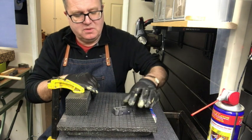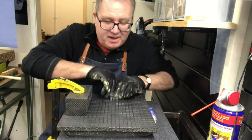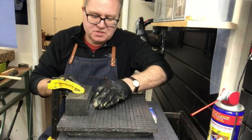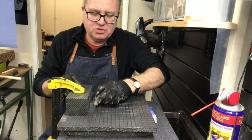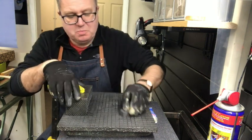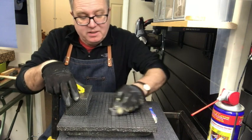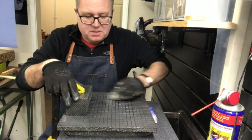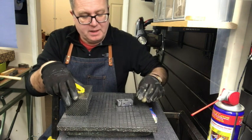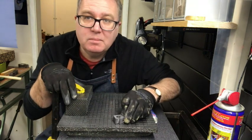It sort of starts to stick onto the plate — you can see when it gets very flat, it starts to stick. This plate here is for the sides if you want to get them very, very true to the base. Each block is going to take about 15-20 minutes. We're going to redo this again after we've heat-treated all the blocks, but for now we're going to do a bit of a soft tool — put it together before we harden it. I'm going to carry on with this, and in the meantime I'll tell you a little bit about reeds.